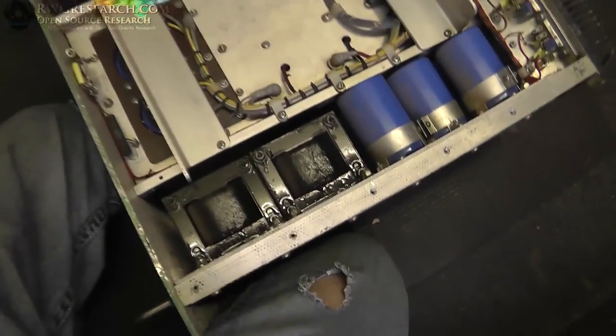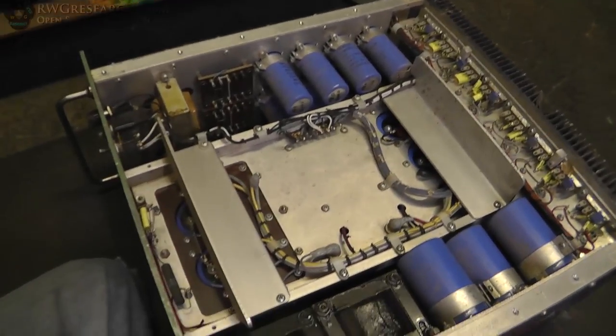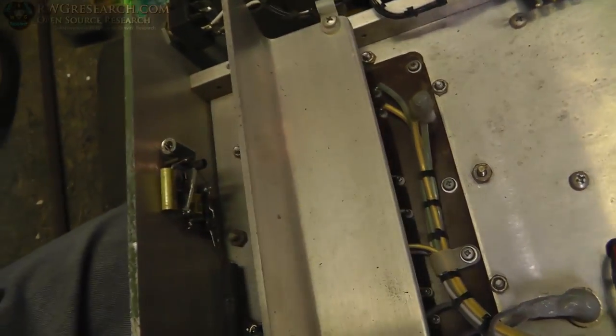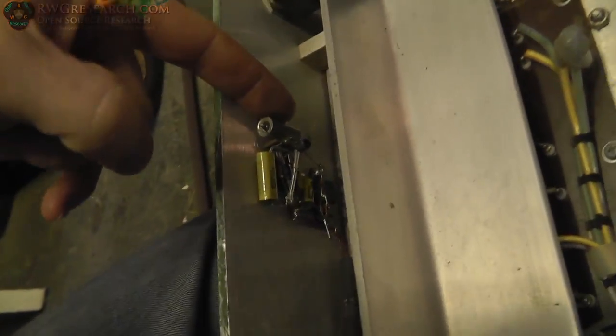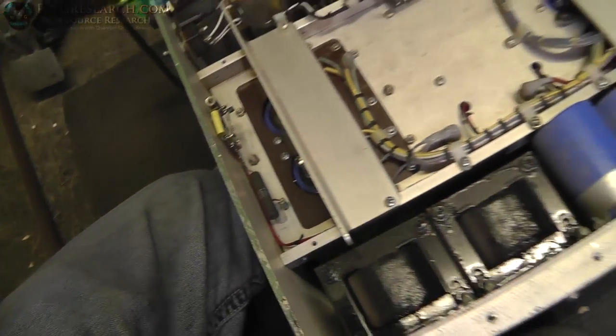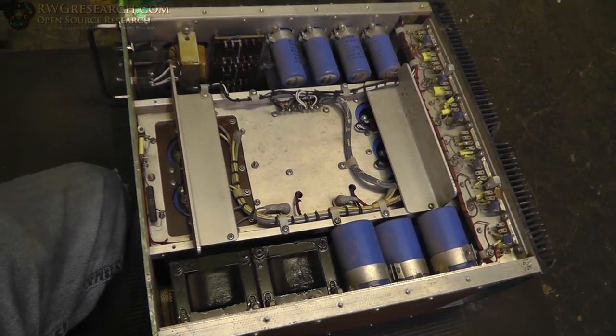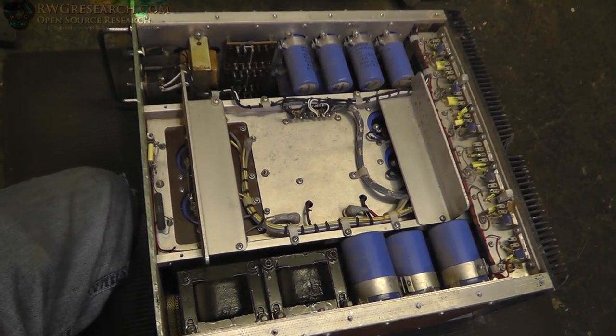Okay, well, I'm going to look around for a little bit and see if I can determine what voltage this thing is, but the bridge rectifier sort of gave it away. It's probably 220 single phase. And look at this little circuit board. It's just sort of strapped on there. Looks like there's some power transistors or something in there. Okay, well, let's have a better look with my eyes off camera and see if I can figure out what voltage this is.